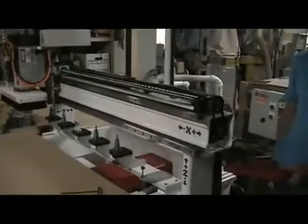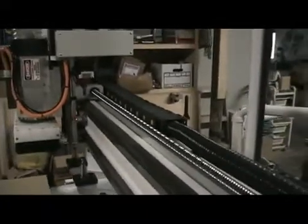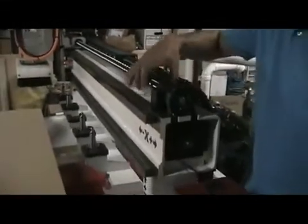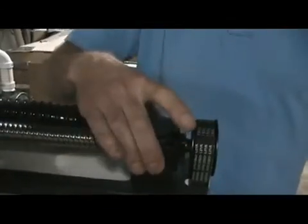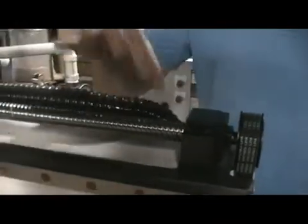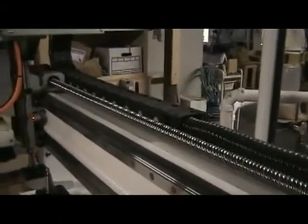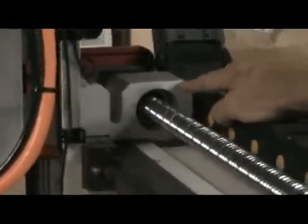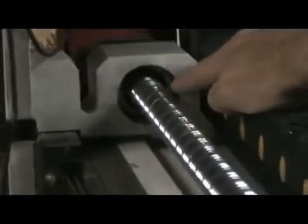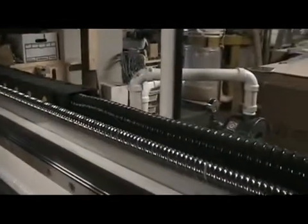Let's get a look at the ball screw. We've taken the cover plate off the machine here, and here's the ball screw across the X axis. There's a nice-sized precision ball screw here on the bridge axis. These are angular contact bearings on the ends of the ball screw — a beautiful bearing set. I see a lot of manufacturers in this price range either turning their ball screws in brass bushings with no bearing at all, or using a very flimsy steel plate with a standard bearing shoved into it. The machined bracket for holding the ball nut — everything on here is real precise, real precision. It's just real industrial quality machine tool components.